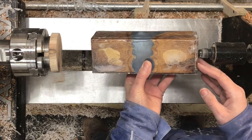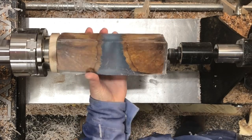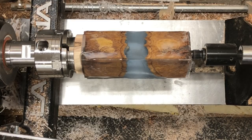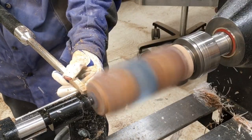I wasn't really sure if that was going to hold up well or not, so I decided to just go ahead and put a tenon on one end, and that way I would have a very solid grip. I wouldn't have to worry about vibration or the epoxy failing or tearing the wood out.